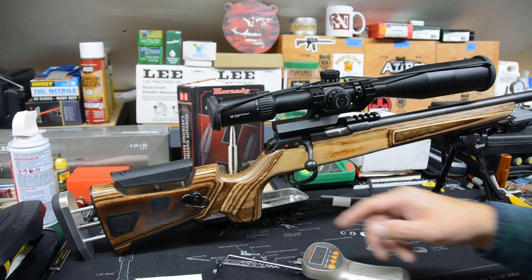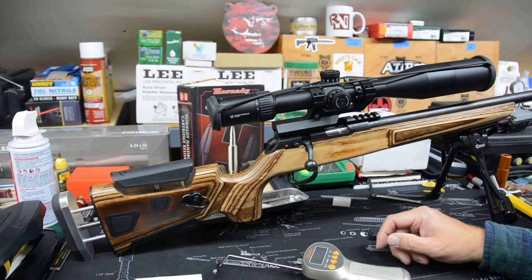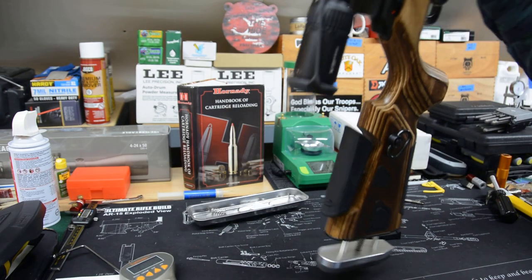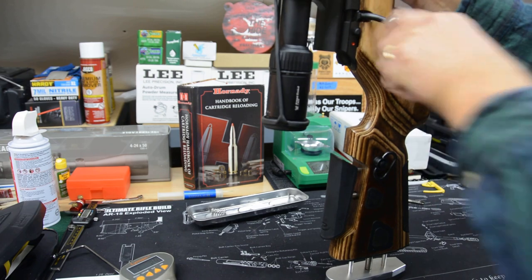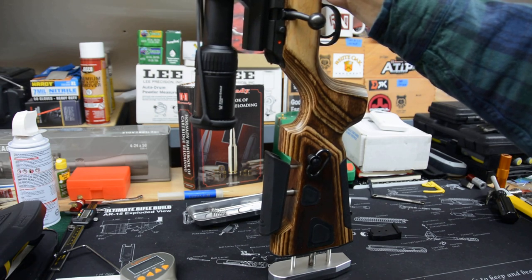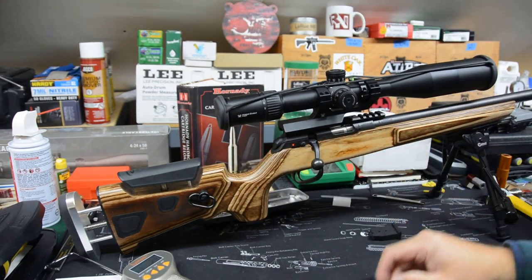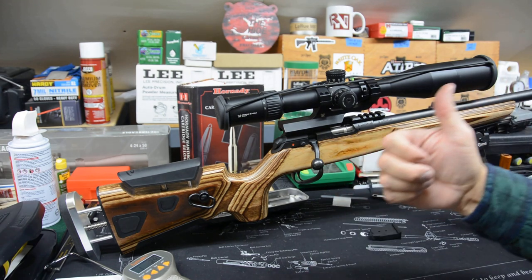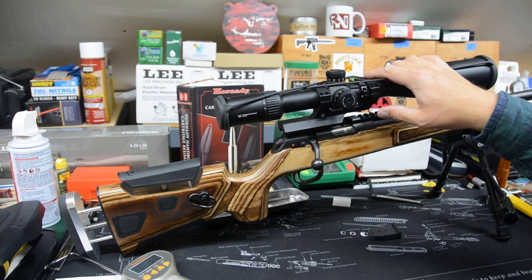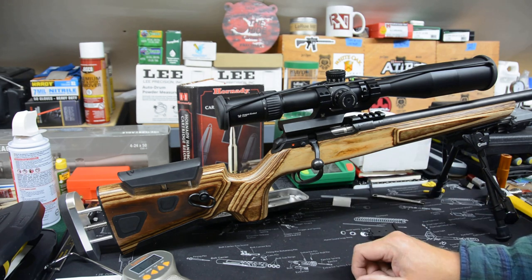I'm really impressed — it's going to be a lot of fun shooting with a basically one-pound, three-ounce trigger, and it can go lighter. I did do a safety check for those of you that have worked on Remington 700 triggers: you set your trigger, then drop it, and you've got to make sure the gun doesn't fire and the trigger doesn't trip. I've done that several times and it's still good — you don't want to be able to jar it and set the trigger off. Next video, we'll take this thing to the range and give it a full workout now that we've got a good Vortex scope on there and our trigger in a beautiful place. Looking forward to it.